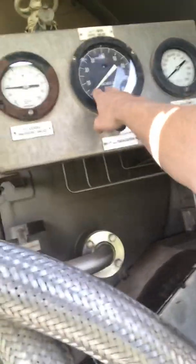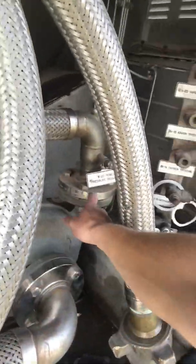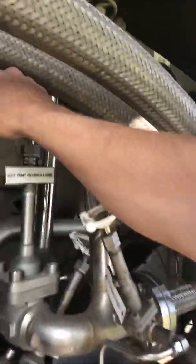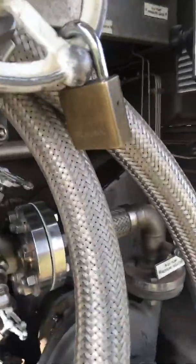Of course, you never want to unload all the way empty because your trailer will get hot. So when you're unloading, you'll come over here and open up your main line out of your tank, then open that one going into your pump. That'll feed down into your pump, and then you go up on your pressure side and follow it around to the pump recirculation and open that up.